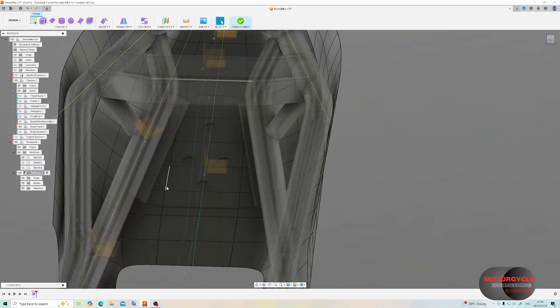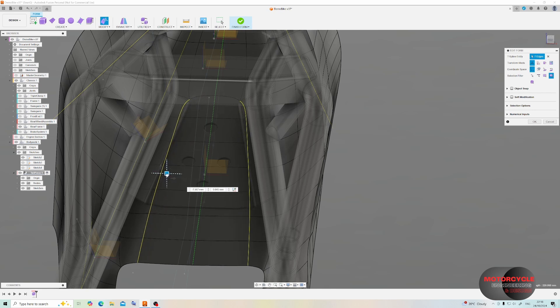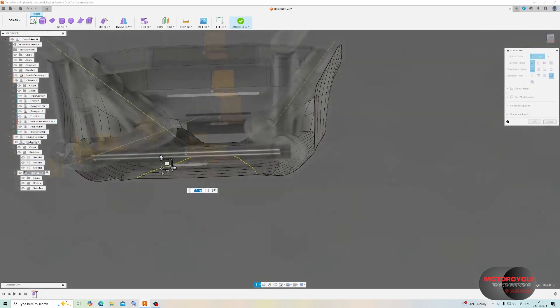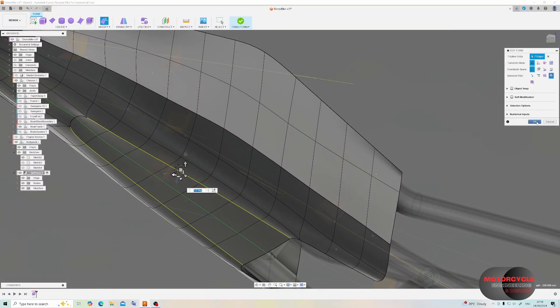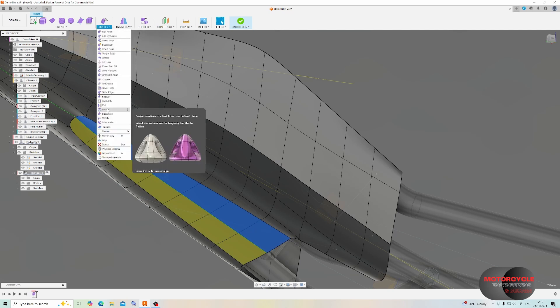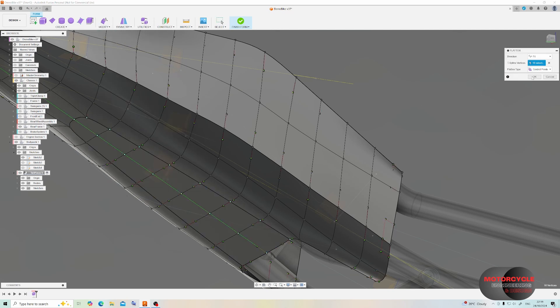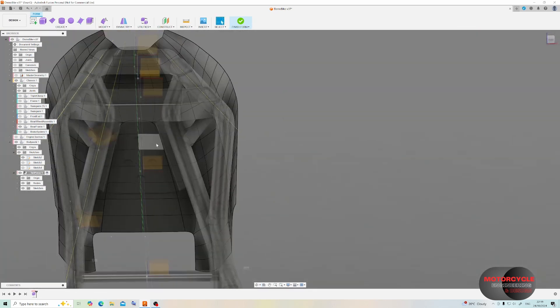When you use the Edit Form control there are also rotation handles. Using those on edges we can create something a bit more interesting, and then use the box to remove things more freely. Since this is going to be a mounting point to the bracket on the frame, I want it to be flat — so if I highlight all these surfaces I can go to Modify and then Flatten. Then I come in and delete a couple of segments I don't think I'll be needing.